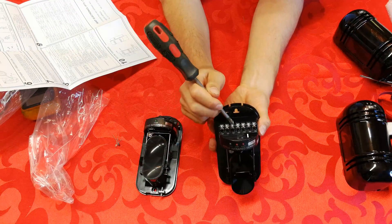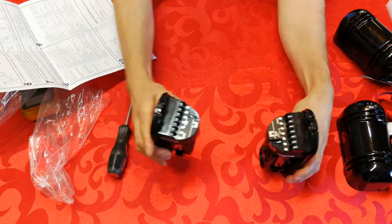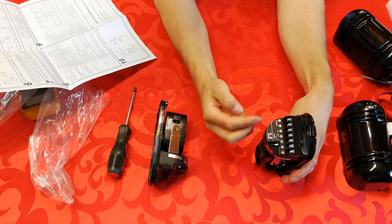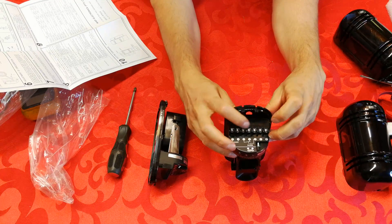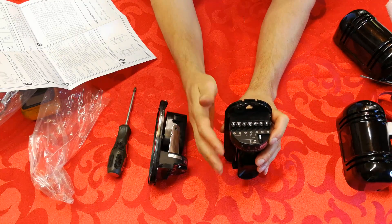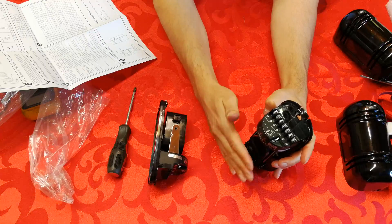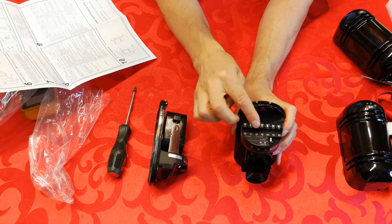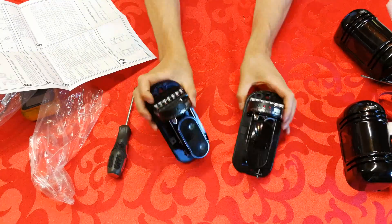The receiver requires more wires because it needs the positive, the negative, and the signal. Once the beam is broken — these units face each other at a designated distance you choose — a relay contact will activate. You can see the contacts across pins 3, 4, and 5. We usually use normally closed, so once the infrared detection is broken, it initiates a relay, opens the contacts, and that goes to your alarm panel to trigger an activation.